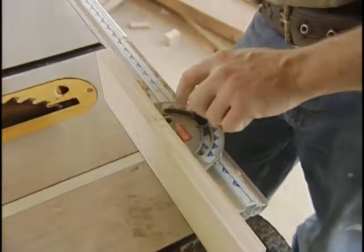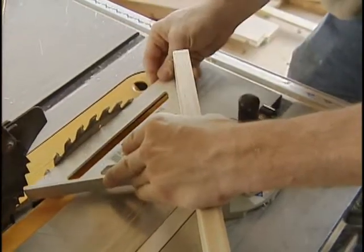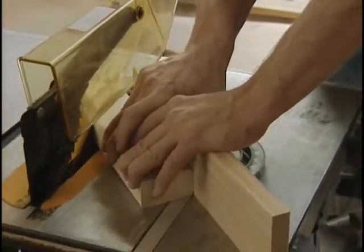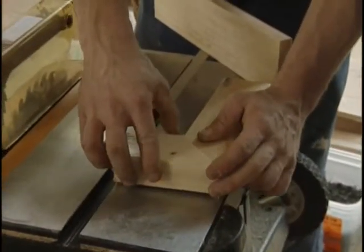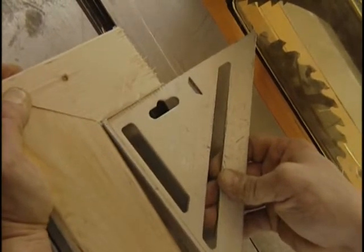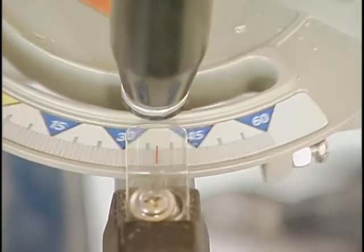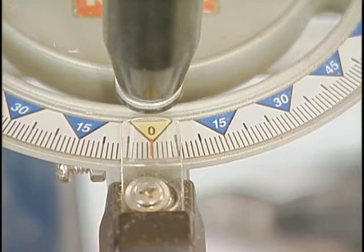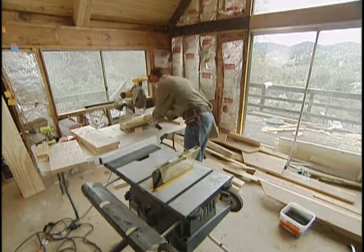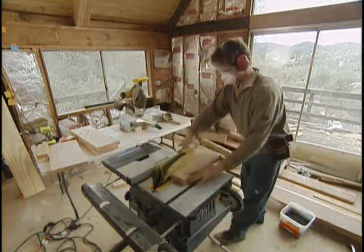You may have to do a bit more fussing around on a table saw. Set the miter gauge to 45 degrees with a drafting triangle — it's the cheapest accurate tool for the job. Make sure the triangle is against the body of the blade and isn't touching any of the teeth. Test the setup by cutting through a board at the 45-degree setting and flipping one of the boards over to form a corner. Hold both pieces against the drafting square — a gap in the joint means your setting is still a little bit off. Once you've got a true 45-degree angle, set the stop on the gauge so you can return to the exact setting time and time again. If the indicator points to zero on a square cut and 45 on a 45-degree cut, you can trust it to be reliable at any other measurement too. However, because it's possible to be a fraction of a degree off without knowing it, you should always cut a few test pieces to make sure you've got the exact angle you want.